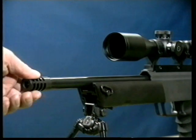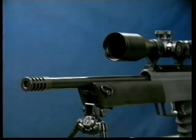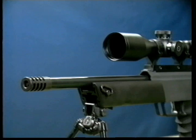The barrel of the Grip Repeating Rifle is free floating and is fixed to the receiver by an annular sleeve. The optical sight is separated from the barrel and fastened on top of the receiver, which is why it is not negatively influenced by eventual barrel vibrations or by heat dissipation from the barrel. Accuracy remains constant, also during prolonged firing sequences.